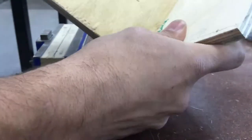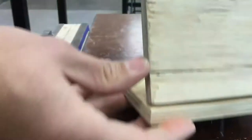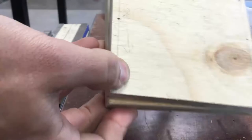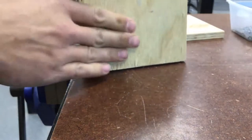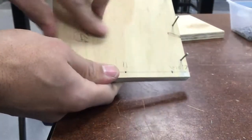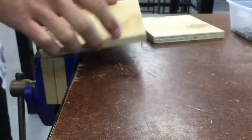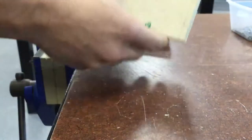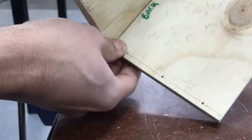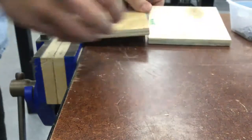With those three nails tapped in, we are ready for the back to join on. There's the base and the back will go on there. Make sure the back has holes running up either side. Once assembled with your base, the rough side should be on the inside and the nice smooth side on the outside. The nails will end up on the outside. Mark it so you can remember exactly how it goes together.